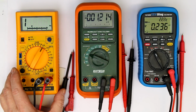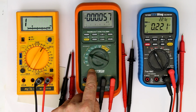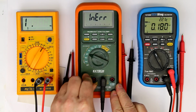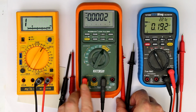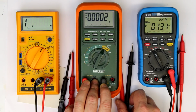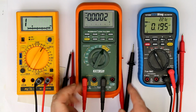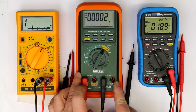And there's another thing you can't see that also has to do with protection of the multimeter and of yourself. In case you're accidentally probing a low impedance voltage or current source and you accidentally are measuring in the amps range, then of course hopefully the fuse of your multimeter will blow, but there might be some strange gases or steam coming out of your multimeter. And the modern multimeters have a double insulated case, quite often also with an additional rubber gasket.